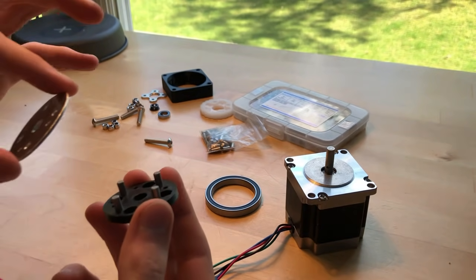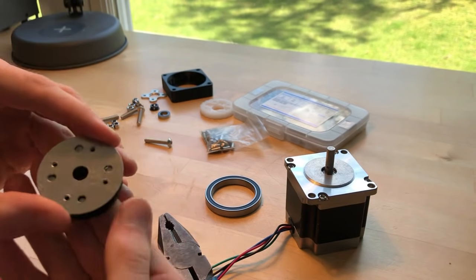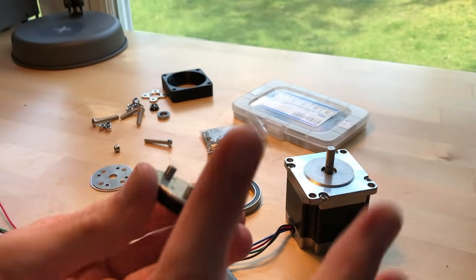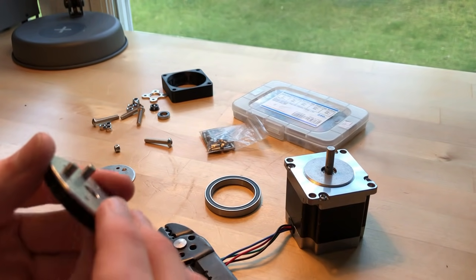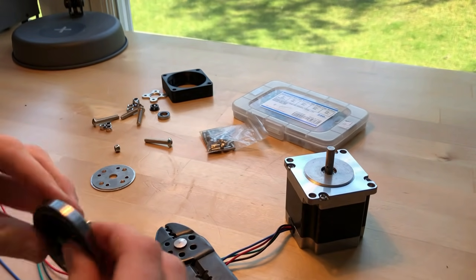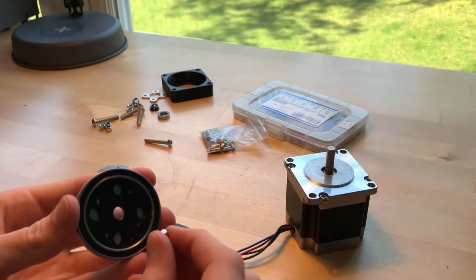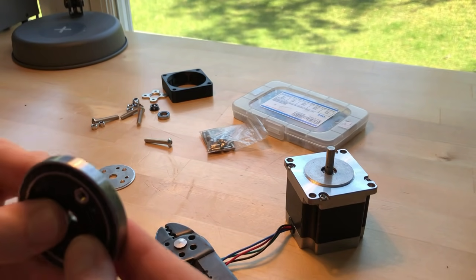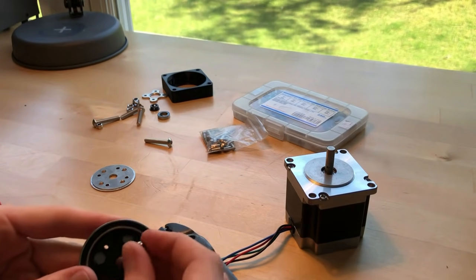So my pins are in there. Now I'm going to try and take my bottom cap and get these pins through the appropriate holes in here. The aluminum cap helps to keep these pins going straight out. Some of them are still bending inwards a little bit, and I'm hoping that'll adjust itself once it actually gets in the mechanism, but maybe not. So now I can take this, push it inside the bearing here, just a little snug, that's good. Now I have these hexagonal holes in the 3D printed piece. Those are there so that I can stick in these M4 lock nuts. So with these lock nuts in here, once I have the other cap on, I'll be able to use M4 screws to go through it and hold on to the output.